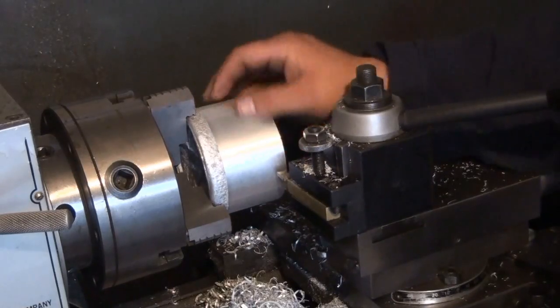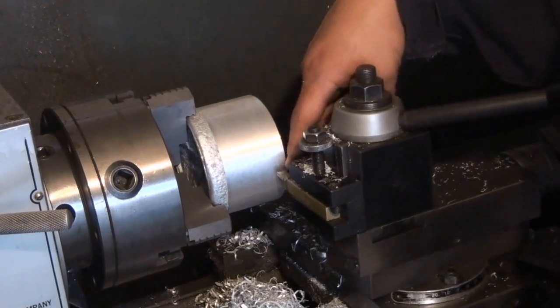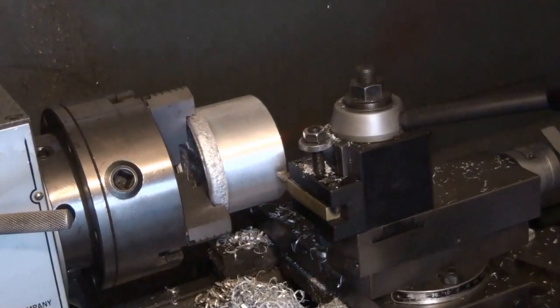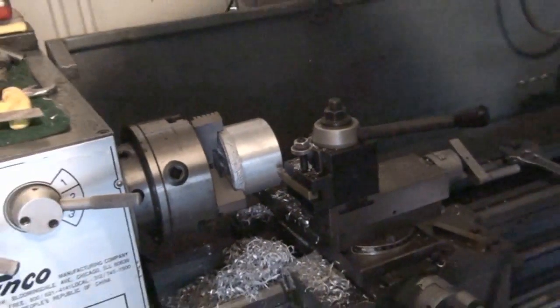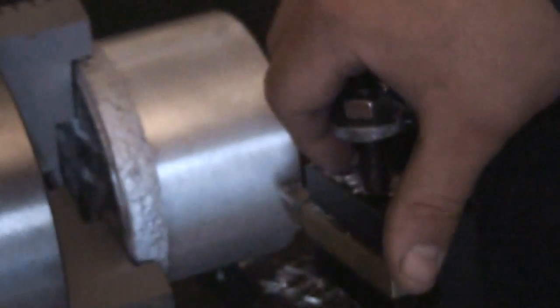This is really smooth — you can actually see the glare off the bit right there, and that's at 1200 RPM. That was actually a five-thousandths cut. Imagine if I take like two thousandths at 1500 RPM — you can see the shine on that thing. For the video's sake I'll try 1500... actually 1550 RPM.